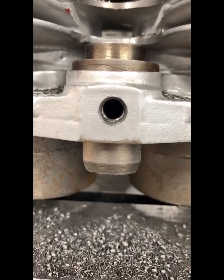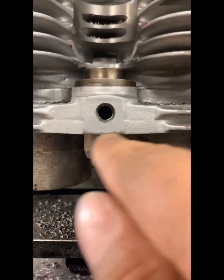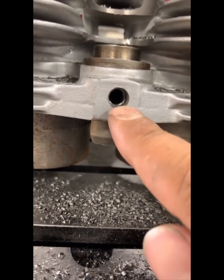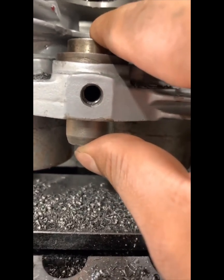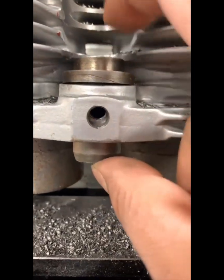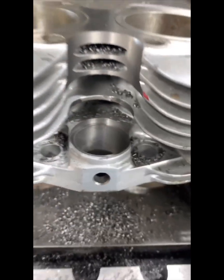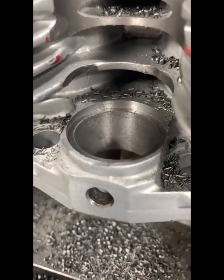Hopefully this might be the last check. It's close. I do have to keep in mind that this surface here is at an angle, so I need to get to that angle. Visually looking at it, I might go down a little tiny bit. The bolt OD will be smaller than this hole here, and this hole is larger than 5/16, so there is some wiggle room if it's too high or too low. But we obviously need to get it visually in the right spot. This tap block is correct, and my theory that the bottom of the shoulder and the centerline of that hole is the same on all tap blocks — that has not changed. So I'm going to do a very light pass, check it again, and I think we should be done.